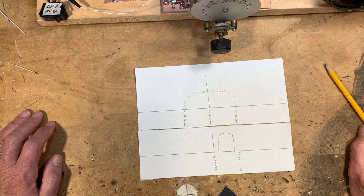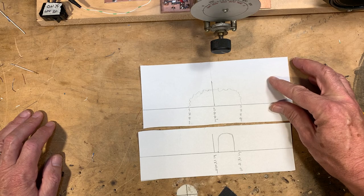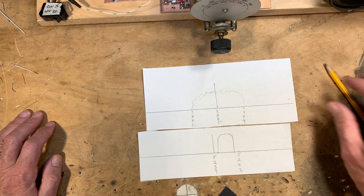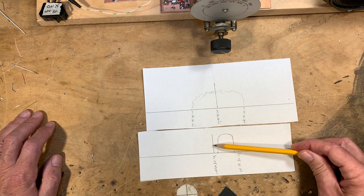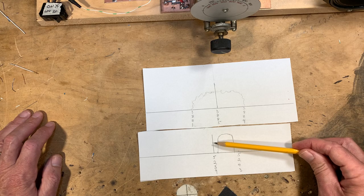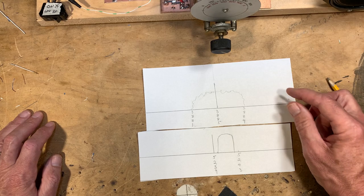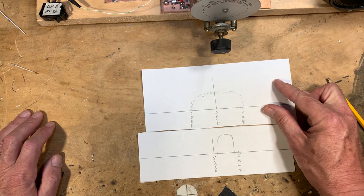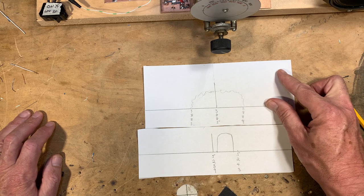In the first video, when I tune in one direction, the carrier becomes very obvious — I'm basically moving this signal up. That strong carrier is in the passband, it's getting through. Not only that, it's off in frequency from the beat frequency oscillator, so there's a strong tone. That's why when I tune in that direction, you hear a 'whoop' — it goes up. Then I go back to zero beat.